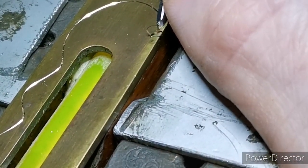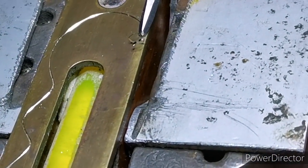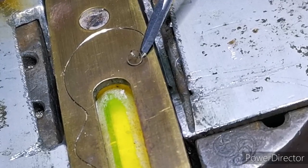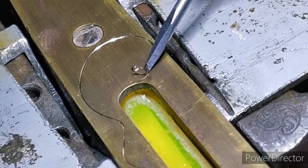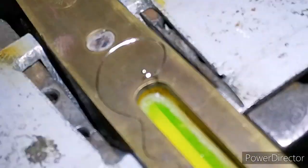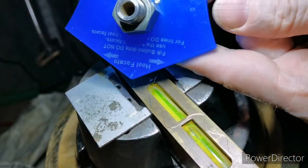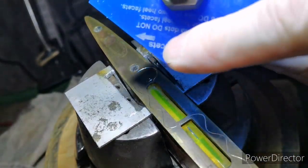What I'm going to explain is the way the graver cuts through the metal — it's like the bottom of a boat sailing through the water. The cutting profile of a graver is roughly this angle, and all gravers are a V shape.